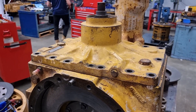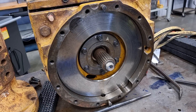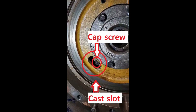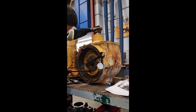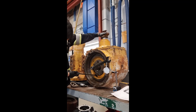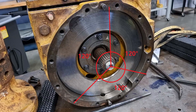As the first step, install the input housing temporarily. Next, position the differential in an upright position. Next, rotate the differential housing until the cap screw is positioned behind the cap slot. Next, install backlash tools onto the ring gear side. Next, install a dial indicator. Next, retain the input yoke and rotate the differential housing back and forth using a pry bar against the cap screw in the cap slot. Measure backlash in three different locations 120 degrees apart.